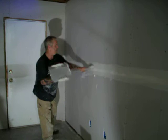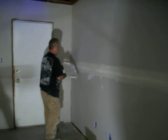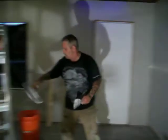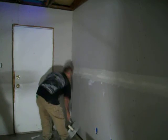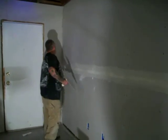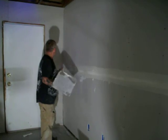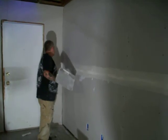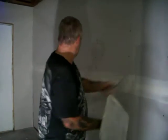Okay, so that's your first bed. After this dries, that's when you're really worried about making it smooth. Like I said before, the smoother your tape, the smoother your finish. So if you start out lumpy, you work it out. Clean off your edges. And that's your first seam.